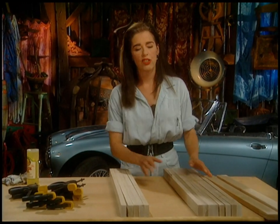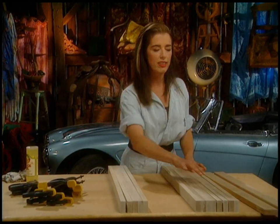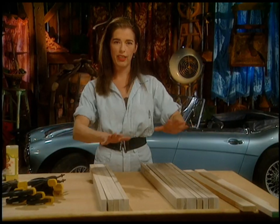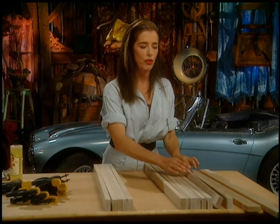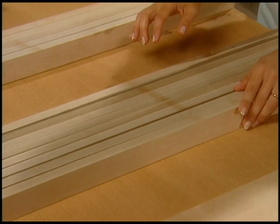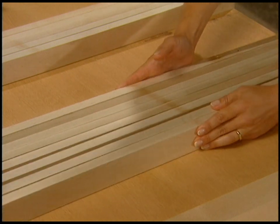You sort your maple at the very beginning. It's important to sort it because some of it has knots in it, like this one right here, and that stuff just does not cooperate when you're trying to get a smooth finish. So you have to kind of turn those boards upside down so that you won't actually run into them. And now look — see how bowed it is? So it's important to line all the bowed boards up in the same direction.